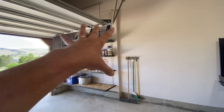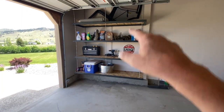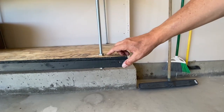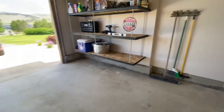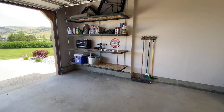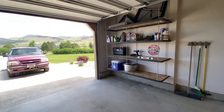You might be wondering about strength. I'm a doer, not an engineer, but I've made several of these threaded rod suspended garage shelves and they're very, very strong — I think four people could sleep here if they had to. In addition to the threaded rods firmly secured to the rafters — this house has an upper loft and is very well built — I also put four 5-inch screws at a slight angle into the studs in the wall on the back side. On the very bottom shelf, I sandwiched it with a nut above and below so if ever there's too much weight, you can shift it up on the bottom end to put some weight onto the floor. I personally got a lot out of this project helping my dad. Hope you enjoyed it — if you got any value from this video, please give me a like. It costs you nothing but is a great value to me. Have a great day, and check out that view!